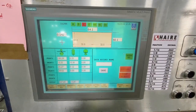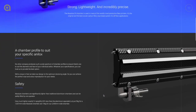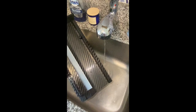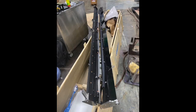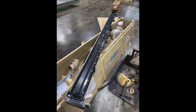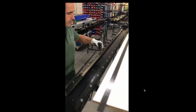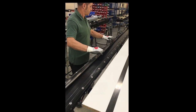After consideration of the plant's pains, we decided on Absolute ink chambers as being the correct solution. The chambers would be lighter, stiffer, and their ability to repel ink and allow for fast washout cycles would be a major upgrade from what the plant had experienced before. The chambers would even come with a 15-year corrosion guarantee. Additionally, spring-loaded blade holders allow for fast and tool-less blade changes so operators can change their blades in under five minutes, a far cry from the 45 minutes it took them before.